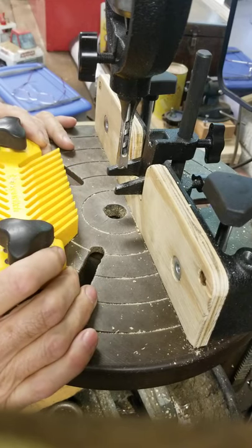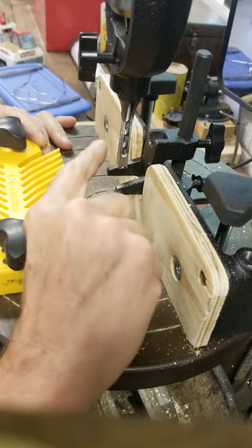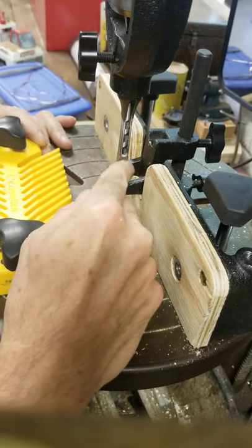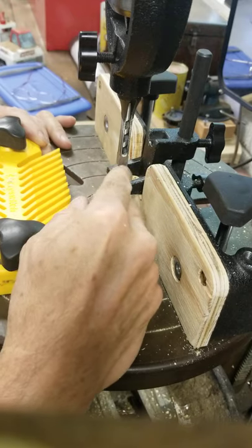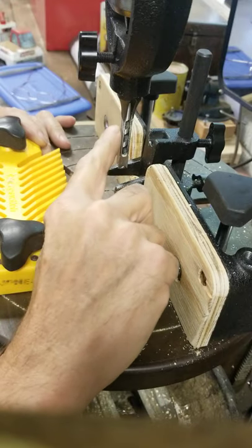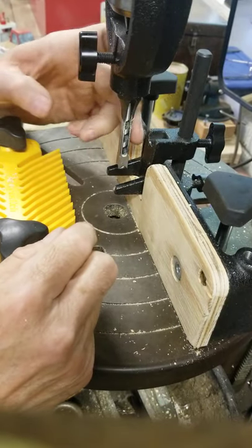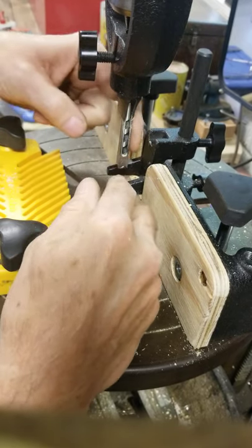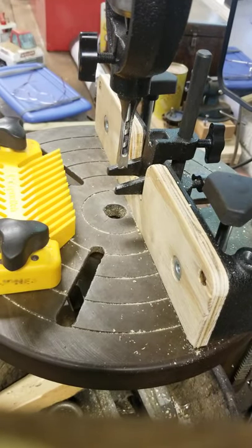And the one other thing I have done in the way of modifications was I put this chisel on my hone, my extra fine diamond plate, just to knock off some of the rough edges. There are a lot of milling marks on here, and I thought, well, maybe if I could make that a little slicker on the side, maybe it would extract a little better. So that's what I did there.